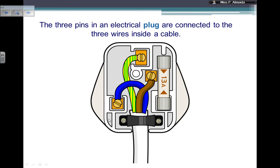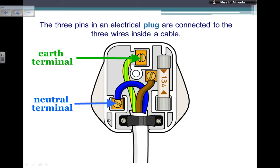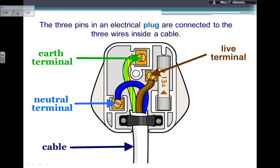How are the wires put into a plug? The earth terminal is on the longer pin — that's where the earth wire is going to be. The neutral terminal is away from the fuse. Then you have the cable with all the wires, and the live terminal is just near the fuse, because that's where the current is going to increase if something is going wrong with the appliance. I have the fuse, which I'll be telling you about next lesson, and I have the cable grip.